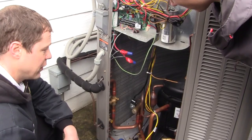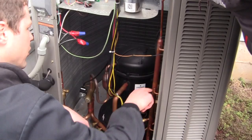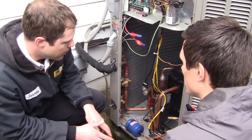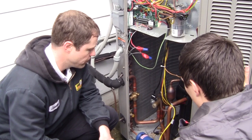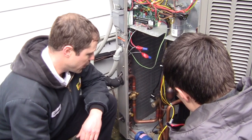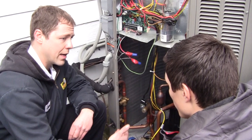When you look in there you're seeing copper tubes surrounded by aluminum fins — much like a radiator that you'd find in a car. All this copper tubing is the method that the refrigerant uses to go from point A to point B. The refrigerant is inside these pipes, and depending on what part of the system you're dealing with, it can either be in a liquid state or a gas state. The refrigerant is really what does all the work — it's used to absorb heat and discharge that heat in different parts of the system.